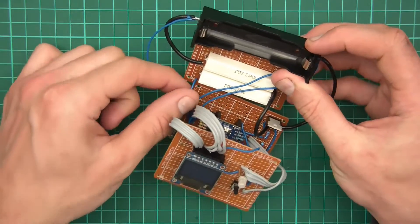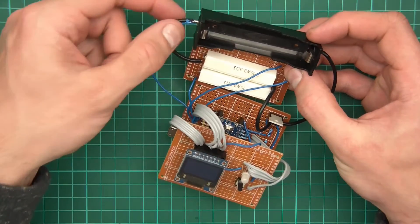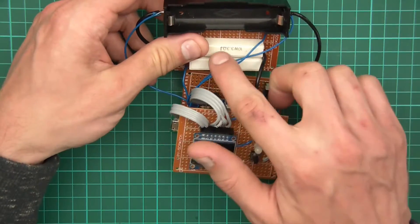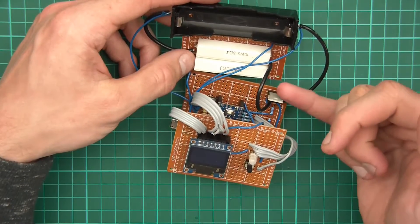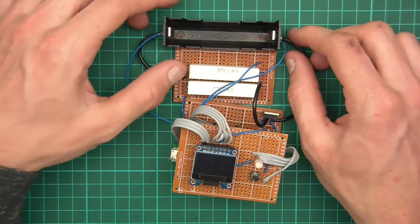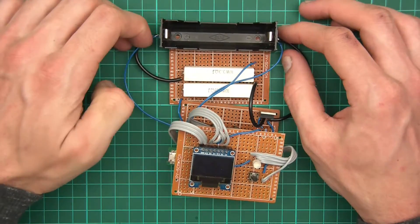On the drain loop there are two more blue wires. One is the pre-load wire — it gives us the voltage before the actual load resistors. The other is post-load, after the drop across the resistors but before the MOSFET drop. Pre-load voltage and post-load voltage together let us see the voltage drop across the resistors, and because we know the resistance we can calculate amperage.